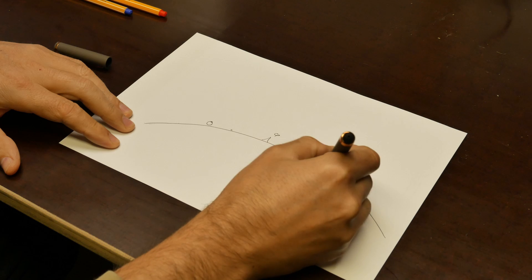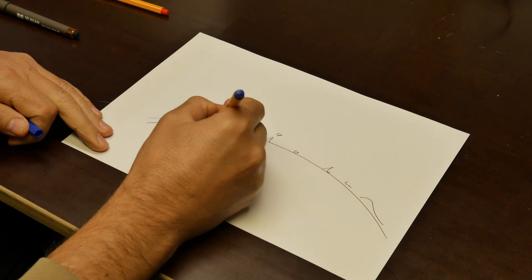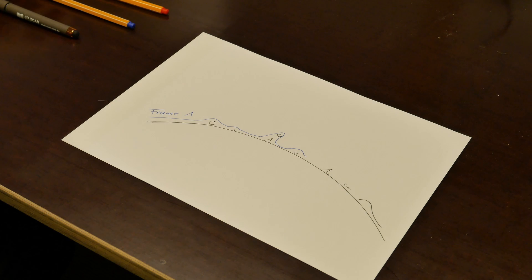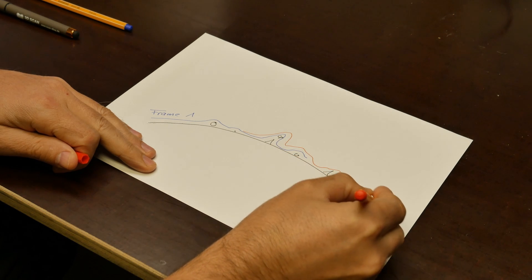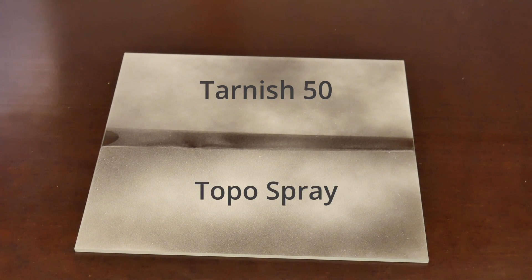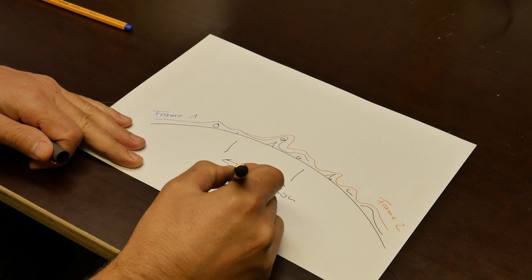The topology spray creates a unique surface pattern locally on your low-featured part. As shown in the sketch, it creates a surface pattern in each of the overlapping frames, enabling the scanner software in real time to get better superposition results without making bigger errors. For cheaper scanners that have a low surface resolution, the benefit of the topo spray might not be as big. There is also a compromise in the size of the particles for the stochastic pattern — if we made it very easily detectable like a wallpaper, it would affect your scan results, and we didn't want that. The actual topo spray creates a pattern that is a compromise between not detecting the topology effect in your scan while still getting good results in the tracking.